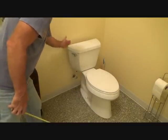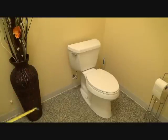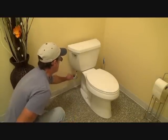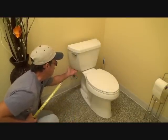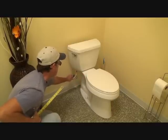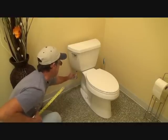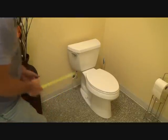The toilet tank should still fit right up against the wall without hitting the wall. The one thing you may have to worry about: look on your existing toilet where the toilet fill pipe is — it's going to be up a little bit higher because this toilet is higher than a standard toilet. So hopefully your flexible pipe is long enough to attach. Worst case scenario, you may have to get a new hose if yours is short.